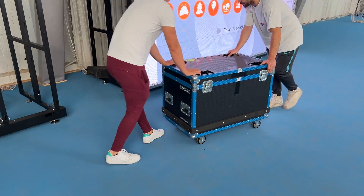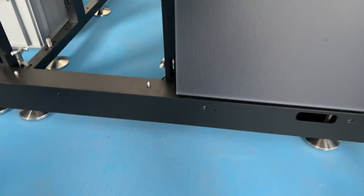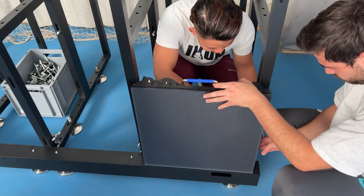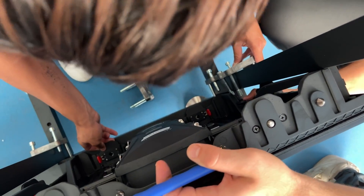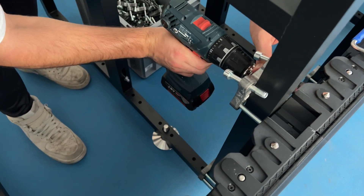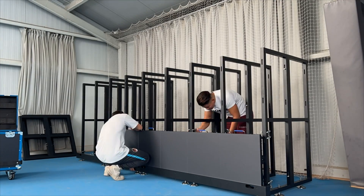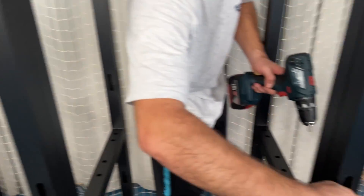Once you've tightened all the screws in the bottom, it's time to put up the first LED panels. Please note all the LED panels are named. When you place the panels, it's always important that you find the little knobs down here so they align perfectly. It's very important to keep the order consistent since all the panels are naturally cut in place so you have the best possible picture. The best way to attach them is to have one person in the front attaching the LED panel and a second person adjusting the screws in the back. Make sure the plate is flat and that you don't over-screw — these are very thin aluminium scaffolding holders, so please don't stress them too much. Once the first screws are attached, align and tighten the screws of the back structure. They should be rigid enough to hold the structure but not too tight.